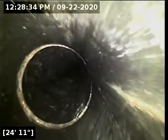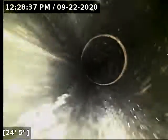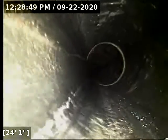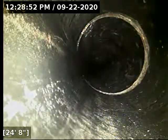But anyway, the concrete pipe is still in good shape. It's still very smooth. All the joints look good there. It's possible, though, you may have about 2 feet of concrete in your responsibility there. You've got minor standing water thus far anyway. Well, we're going to push back out here just to see where it dissipates. So it looks like it all stops here at about 25 feet.